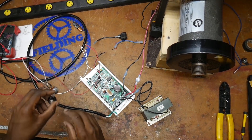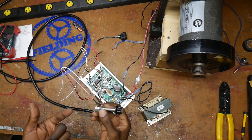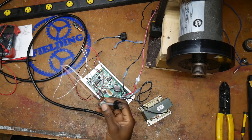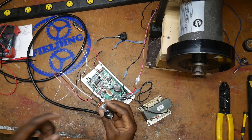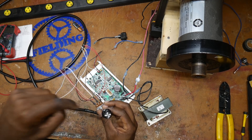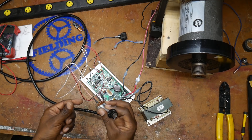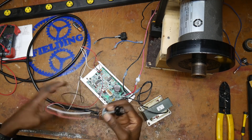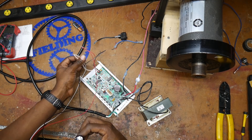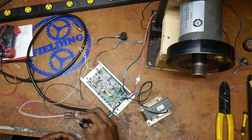I've got my potentiometer wired up. You may have noticed I didn't solder the wires — I used heat shrink wrap instead. That's because my soldering is an abomination, but I am practicing. I just cut the wire real long, wrapped it around several times, went through the hole, and then heat shrinked it on — that's a good solid connection. I've connected it up to the corresponding wires, so let's see how it works.